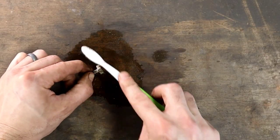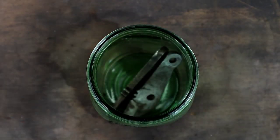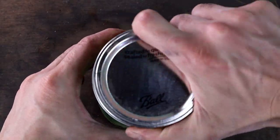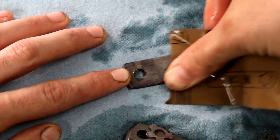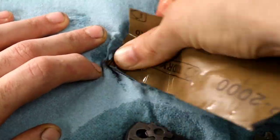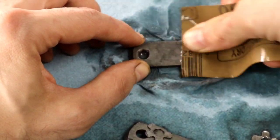I left the parts to soak in the solution overnight. Depending on how fresh your batch is, newer solution will only take a few hours to work on light rust, whereas older solution or heavily rusted parts are going to require more time. After the soak, I used 2,000-grit sandpaper to clean up any leftover residue and to help the buffing pad do its job. For scratches, I normally start with a 120-grit to see how they come out. Anything lower and you risk taking out the factory finish. You'll need to weigh out the pros and cons of whether you're willing to sand down to any of the pitting.